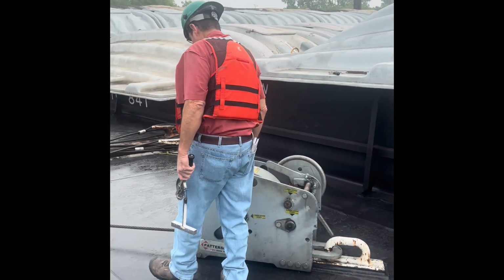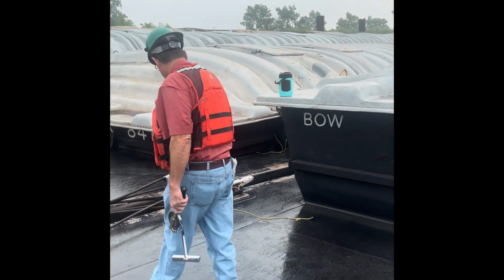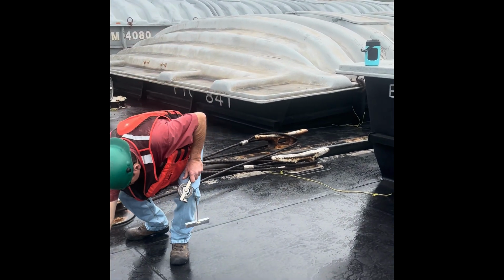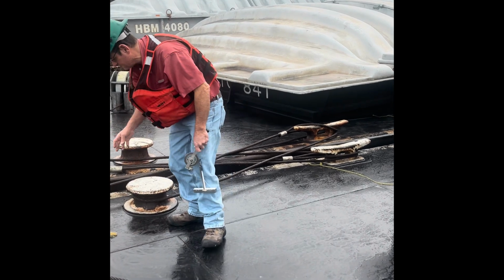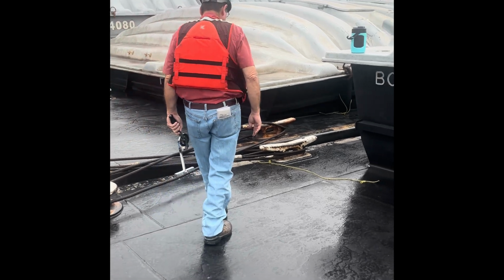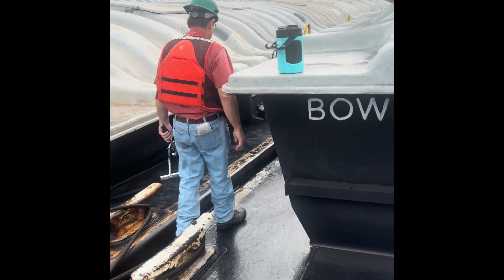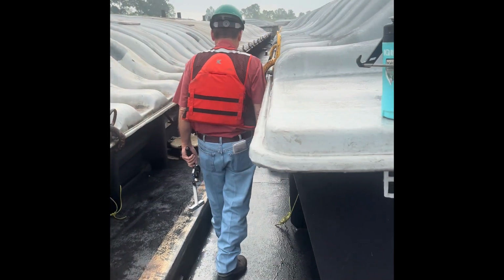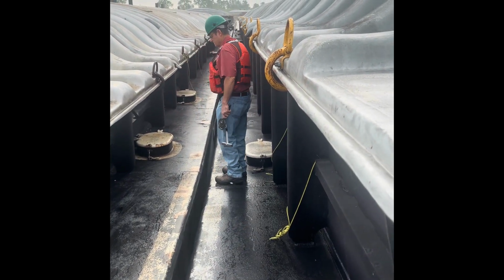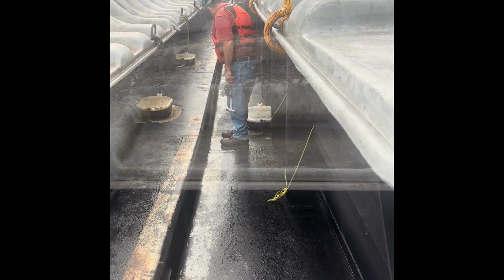From the time we climb on the barge from a dock or a boat, dangers exist in every form or fashion. The decks of the barges on which we walk are very small and narrow, as well as cluttered. There are kevels, cables, loose debris, wing tank covers, water, and at times slippery product. When walking on these surfaces, a surveyor should always watch his step to ensure that every foot is placed in the right spot to maintain balance. Balance and sure-footedness is always the goal, because one wrong step could possibly leave you with your feet and legs in between barges.